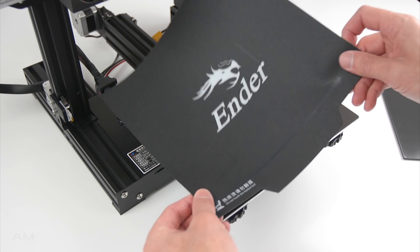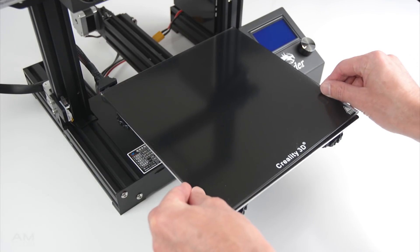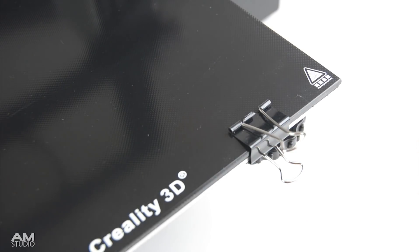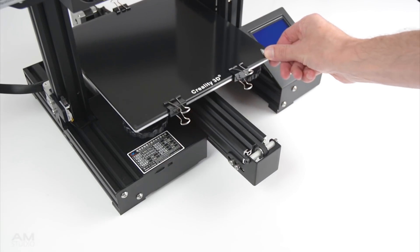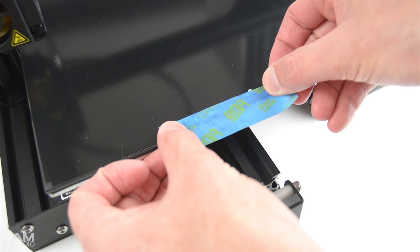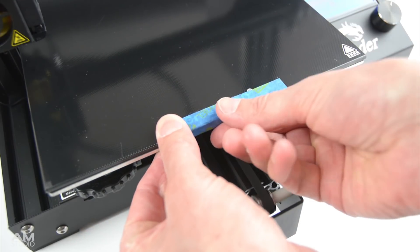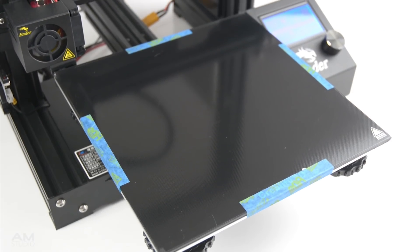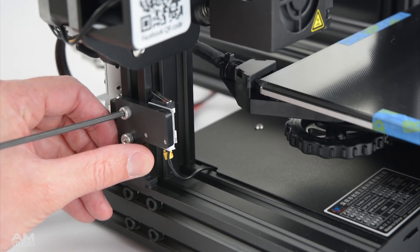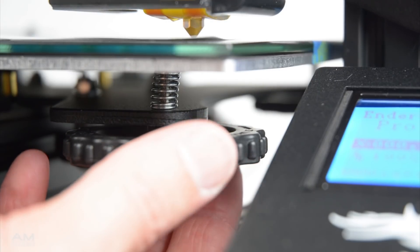To install the non-adhesive glass, we can lift off the magnetic sheet and place the glass onto the bed. The glass can be held on with binder clips, although these are sometimes in the way of the hotend and moving parts. Another option is to use four lengths of blue masking tape along the four edges, so the hotend can easily pass over the edges without any issues. With the glass bed in place, the next step is to reset and move the Z-stop to match the same thickness of the glass, then re-level all the corners of the bed and check the accuracy of the first layer.